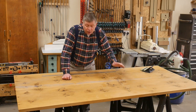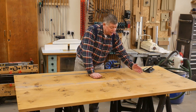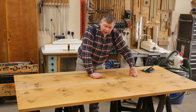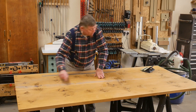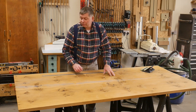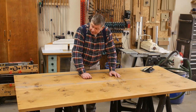There are some dominoes in here — I do know that there are dominoes. I don't know how many and I don't know where they are. So if I just cut this off at five foot, I run the risk of cutting through a domino and having it showing at the end of my table. So I am going to cut down this center line that's already been jointed, and that will tell me where these dominoes are. And then I can work out where I can cross-cut safely without exposing one, and take it from there.